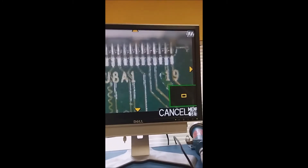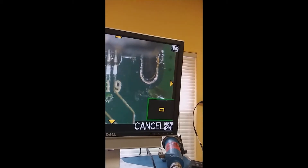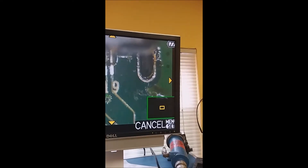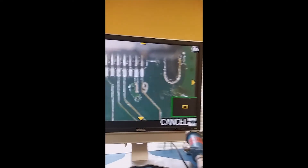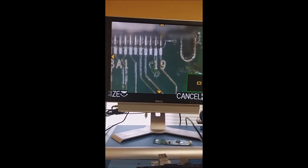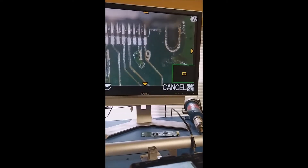All we've got to do now is add the legs. You see how these are incorrect legs — you cannot solder something and have your legs look like this. The legs have holes right there; it's not coming through from the bottom side, which means your legs are not correct. You've got to redo the legs. So we're going to do the legs right now, put it back together, and test to see if it was just only an HDMI port issue — because it seems like it could be a little bit more than that.